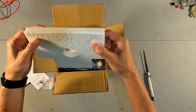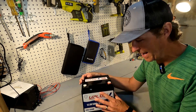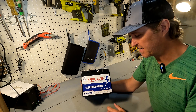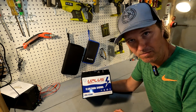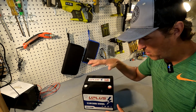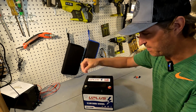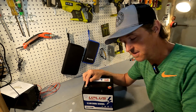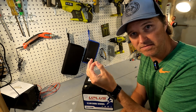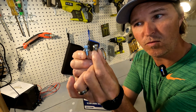We have a thick piece of hard styrofoam and then the battery. Looking at this battery it is very unassuming. It's just a black case battery with a label on the front that says Uplus, and it tells you that it's a 12.8 volt 50 amp hour 640 watt hour lithium iron phosphate deep cycle battery. There's a small label on the top and everything else is just jet black. One thing I noticed right off the bat is it does have these terminal cover little plastic terminal covers, which is nice, but they use M6 bolts, which are quite a bit smaller than M8.